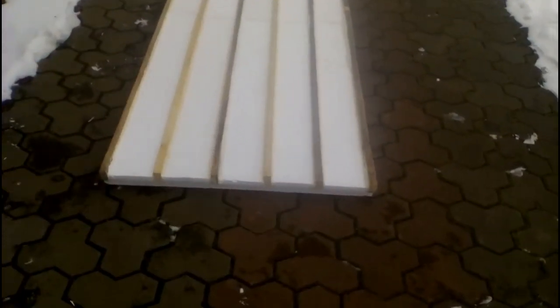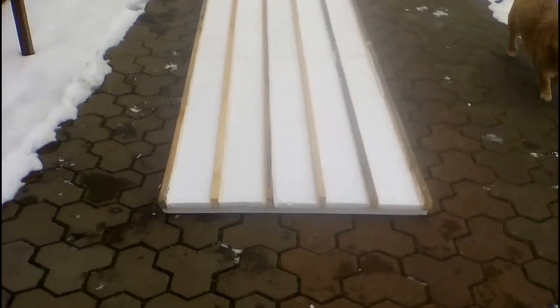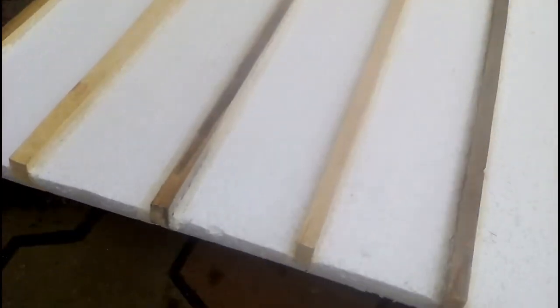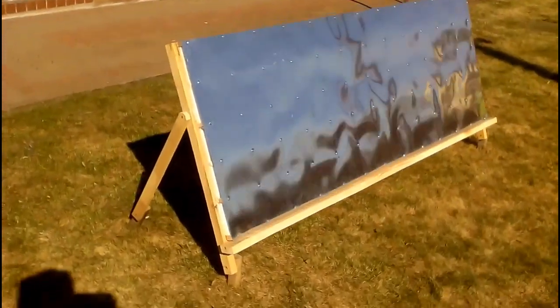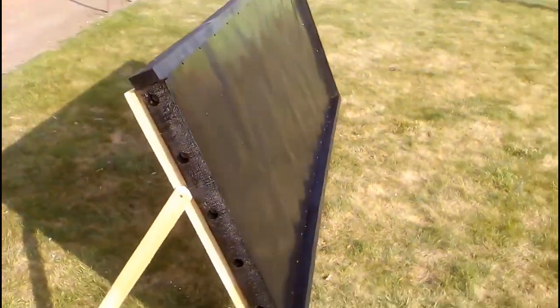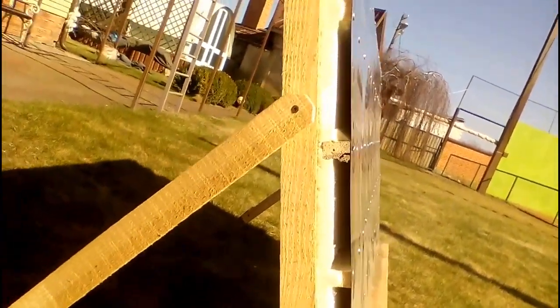This is my choice of the cheapest body for my collector and its thermal insulation. We see that this is expanded polystyrene and several wooden battens which must resist wind, weight and pressure of water. This thin steel sheet is my choice for the cheapest absorber, and I coated the sheet with cheap black paint. We must pay attention to these holes for the circulation of water which will take solar heat from the black steel sheet.